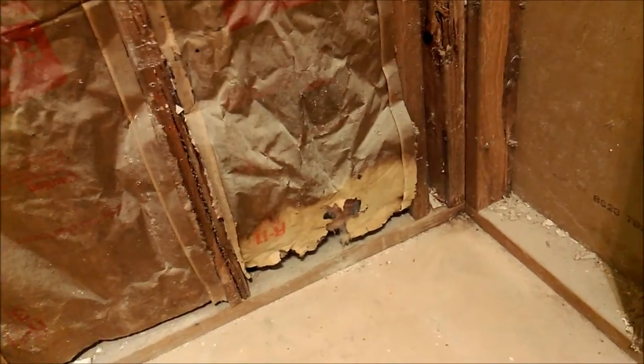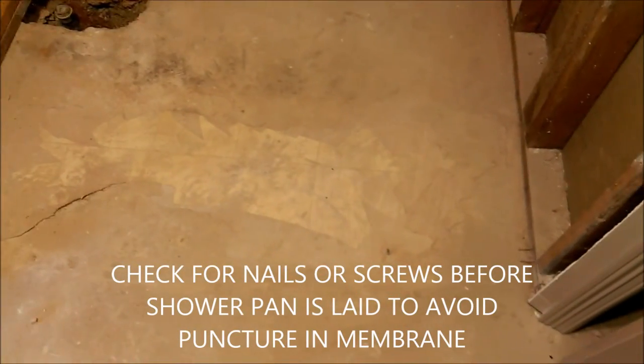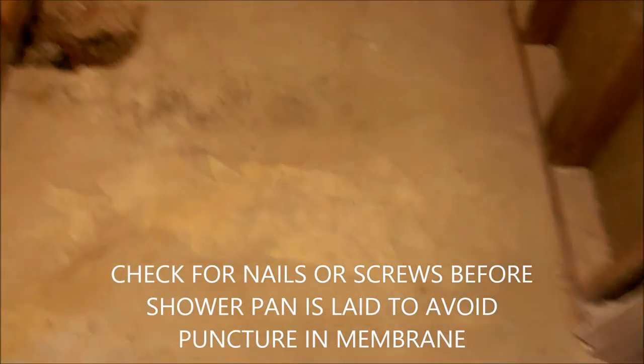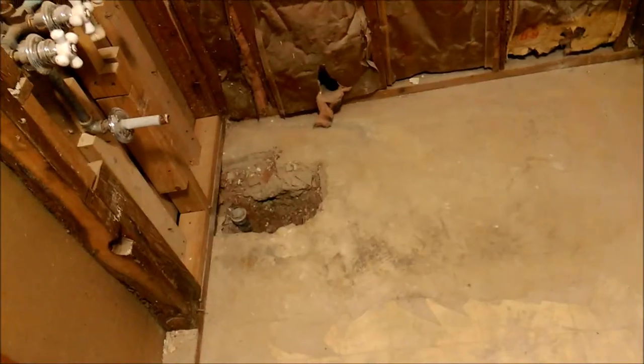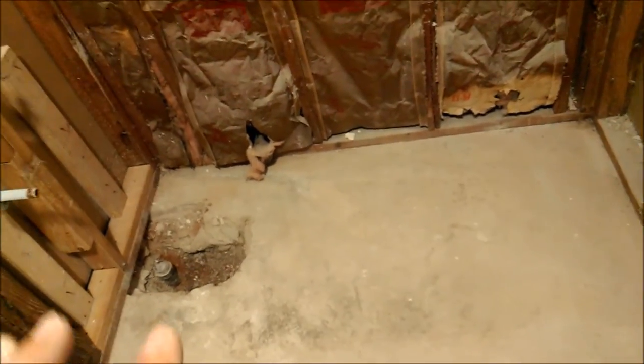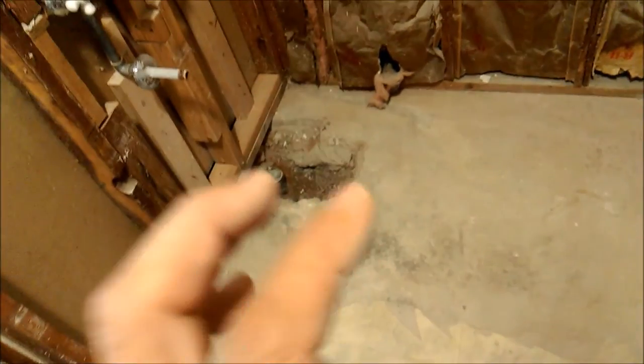You can form out your bench — on this particular one we're going to do 16 inches deep and the width of the shower, which is four feet all the way across. Clean up your area so you have a nice clean area to work with. I'll document and take pictures, showing you how to install the drain before you set your cement. This is for a shower pan on cement — there are different procedures for a shower pan on a subfloor or wood floor, but this is going to be on cement.